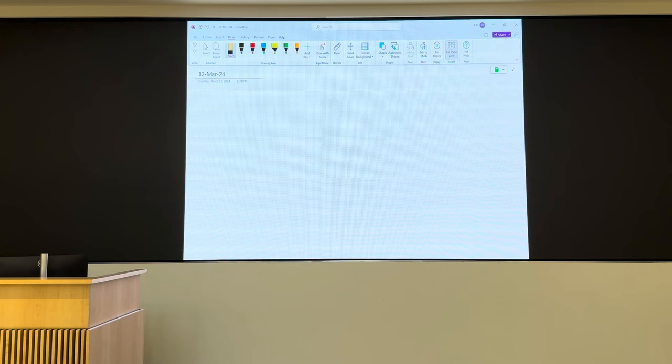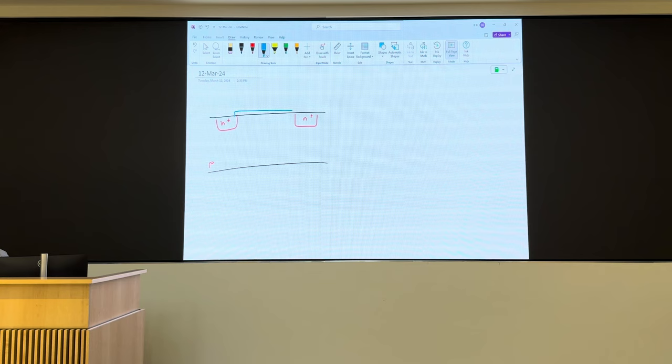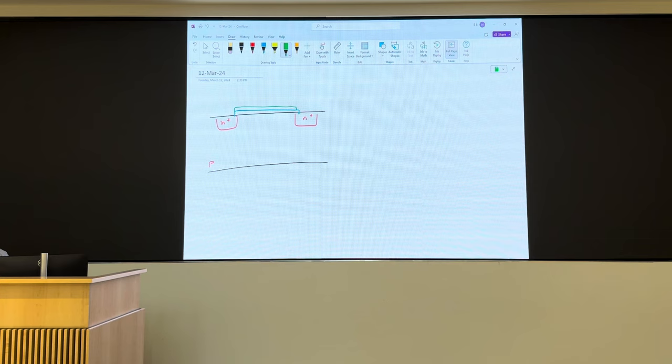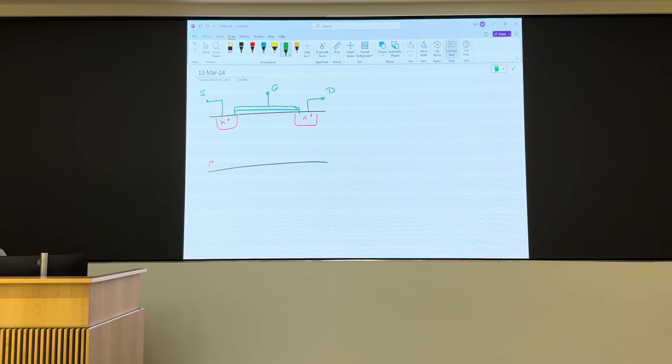We talked about our third new device in this course. It was a MOSFET. We said you make them using typical microfabrication technologies. You need to have doping and film deposition and etching and all that. But the structure was like this. We had a dielectric over a channel that extended from the drain to the source. We had a contact to the dielectric above that channel, and two contacts to the two doped regions at the end of the channel. We call them source and drain. And we have a contact to the P side, to the substrate here as well. We call it the body contact, and I'll tell you what we do with that body contact in a second.